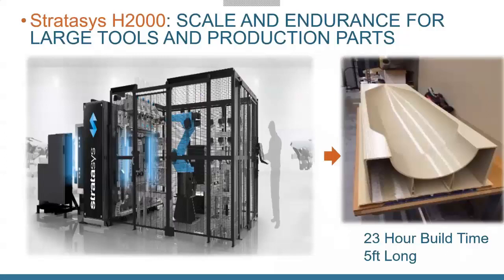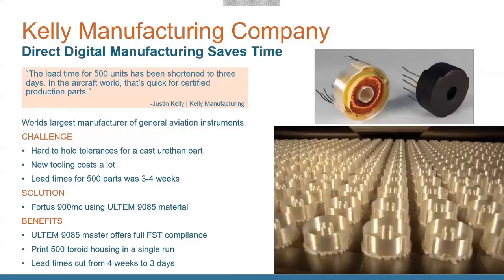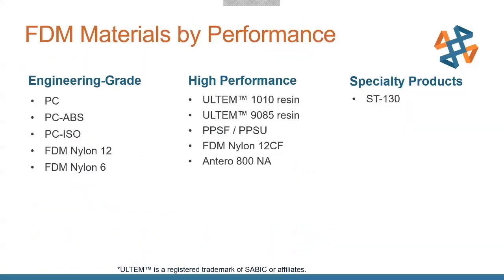That covers a big rough overview of a lot of the options you can do with large 3D printers. It's more than just big parts — you can print lots of small parts, and in the bigger machines you get more access to higher-end materials. Many of the examples highlighted Ultem 9085 because it's such a strong, durable material, but there are also great newer options like Nylon 12 Carbon Fiber and Antero 800NA for end-use parts, or even large volumes of polycarbonate parts.